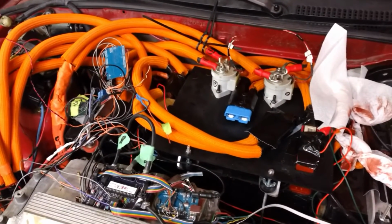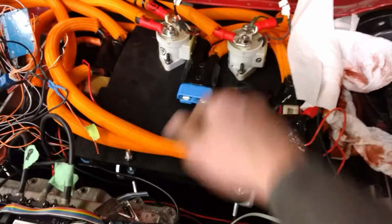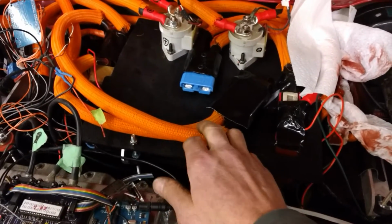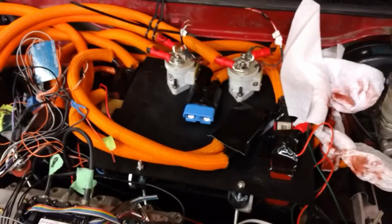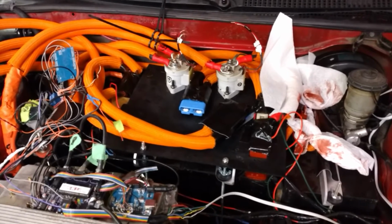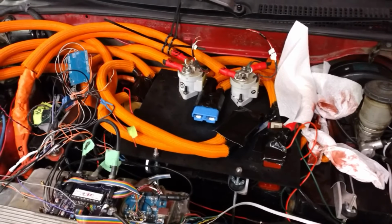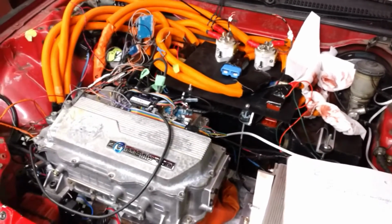Everything is, this is a 175 amp Anderson. It's actually running dual wires, joining the top half and the bottom half of the pack together. That's actually a safety disconnect just to make working on it a little safer. So it splits the battery in half, and means the whole system's at least somewhat isolated, so if you grab any wire, you shouldn't actually be connected to anything.